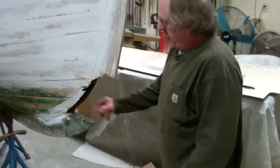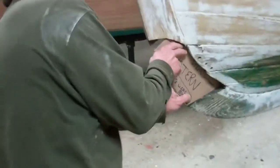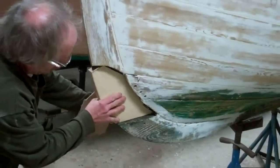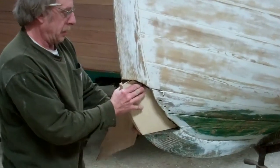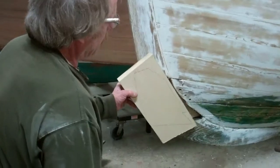I'm not surprised. I've gotten down to where there's good wood, and I'm going to make a big piece of wood for a plug right here to fix the stem. I made a pattern, took a blank of hardwood and started to cut in. I'm going to do it in two halves — that way I can Dutchman it in, overlap it and fit it. I've got the second piece in here; all I'm going to do is cut it out and fit it in.